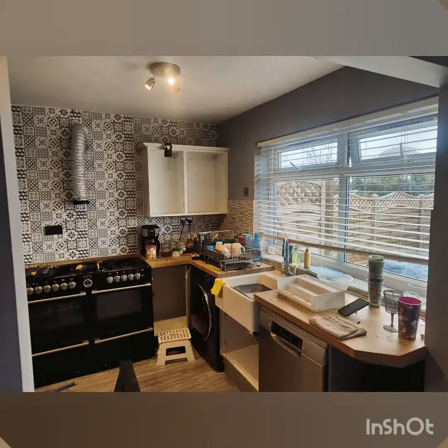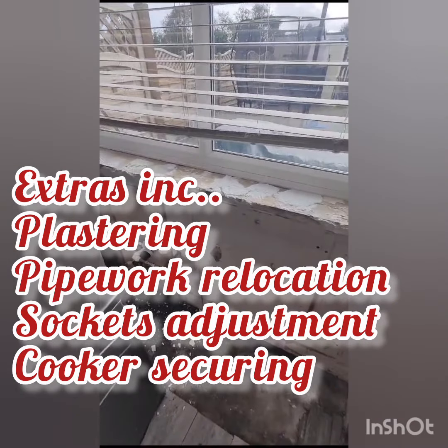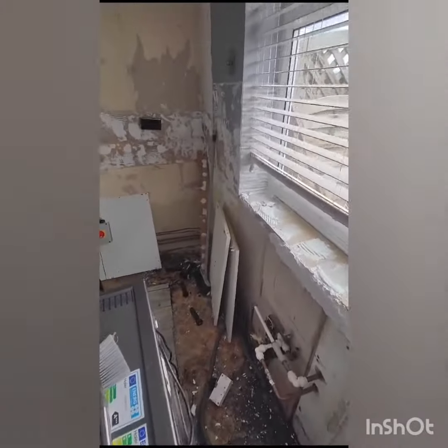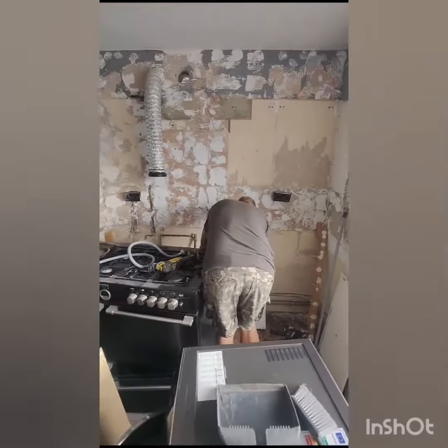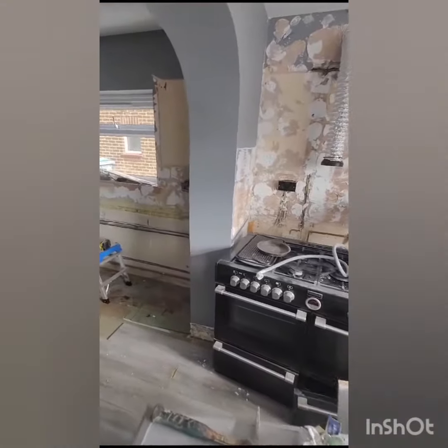Kitchen rip-out. This was a friend of mine, so I gave them an estimate, got it as close as I could. This is defending the trades a little bit, because until you get the old kitchen out, you don't know what's going to come up and bite you. Like there, we had to renew the windowsill. All the plumbing down the bottom there — they only moved their kitchen around a couple of feet, but of course that means all the plumbing's got to be moved.